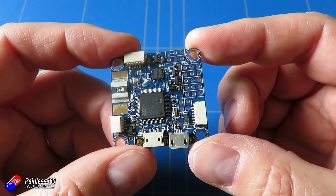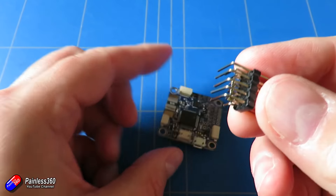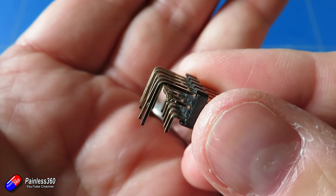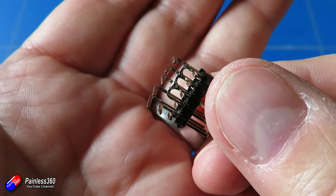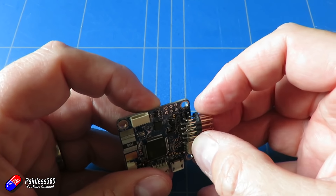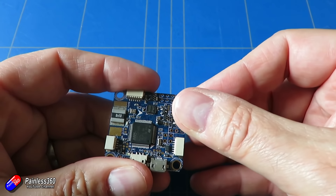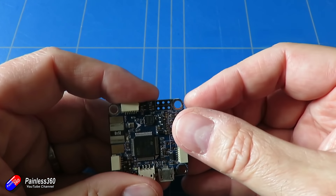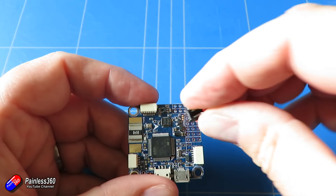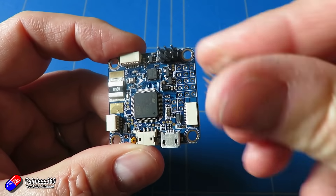I've waited a little while for the code to settle down — there's been lots of developments. The ability to put ArduPilot on small flight controllers has been really enabled by the use of a ChibiOS underlying architecture. The bottom line is it means we can put one of the most tested, reliable GPS firmwares onto flight controllers costing 20 or 30 pounds, rather than having to use clone Pixhawks or Pixhawk cubes which cost the best part of a couple of hundred pounds.